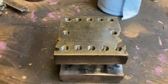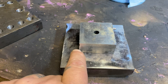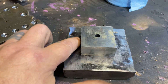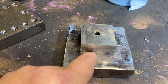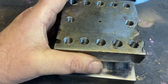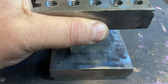So this is where we're at so far. This is going to be the base. I cut another piece of steel and precision-ground it into a two-inch square — well, I cut a chunk with my angle grinder and stuck it on my belt sander, that's about as precision as we get around here. This will be the middle, and this will be the top. Kind of looks like a four-sided tool post. I'm going to give a bit of a chamfer on this edge, bolt these two together so they're nice and square, run a bead weld in there so it penetrates nice and deep. But I don't really want to weld the top on because I want to make this tool post adjustable so I can raise or lower the top for larger tools.